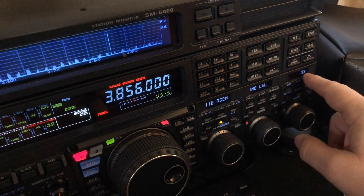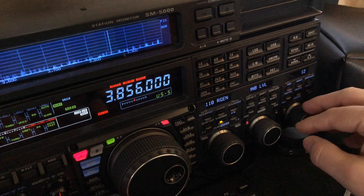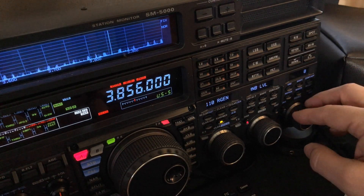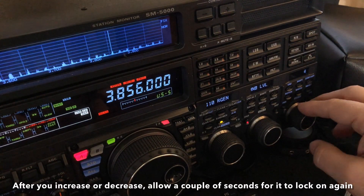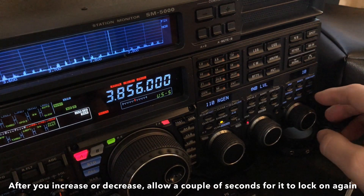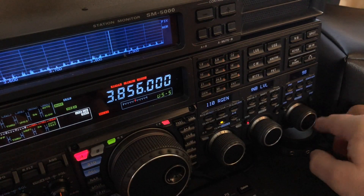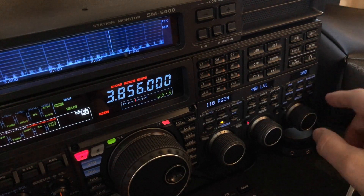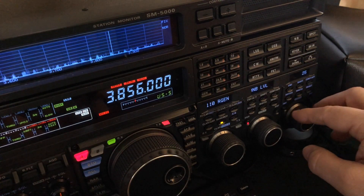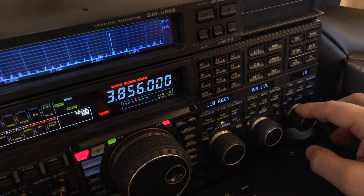Caution: you don't want it searching too wide. If it searches too wide, it will begin to degrade the audio of the people you're listening to — that gargling effect or a raspy voice sound. Even though the scale goes up to 100, only use what you need to. I'm at 18 right now for width and the level is at 33. Running the level high along with a high width setting will get you into distortion.